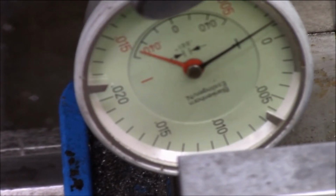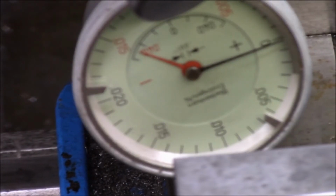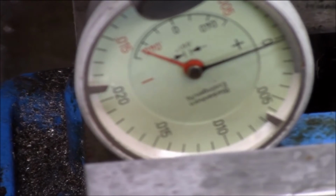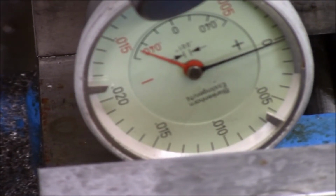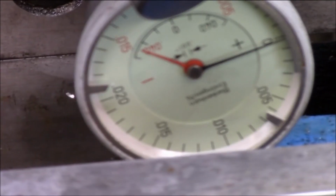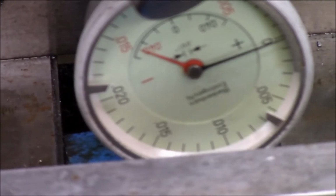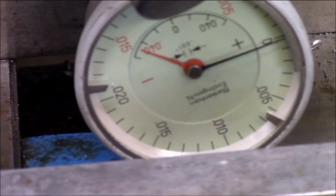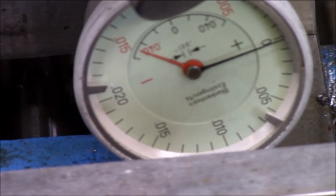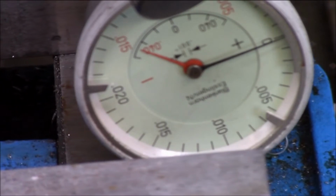Let's get it on 0 for all you folks that like to see zeros. Let's see what it looks like. I just tightened it up, and last tighten up, I've got it just doing the feed. I checked it, it's within 0.5 thousandths, and that little back plunge indicator right there is the bee's knees for this job. This is a little old knockoff Noga indicator, and I just set the vise back up on the mill a second ago, and I just lined it all back up. Like I say, that's the bee's knees for this job.